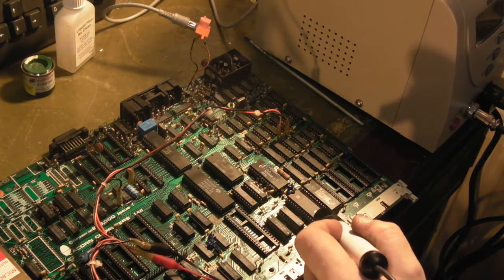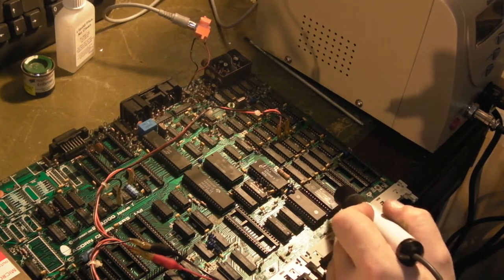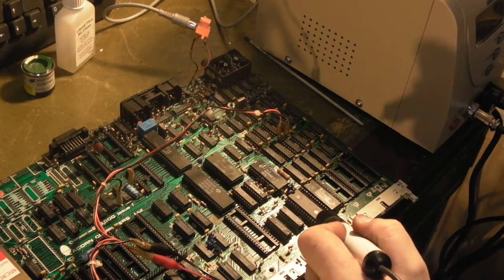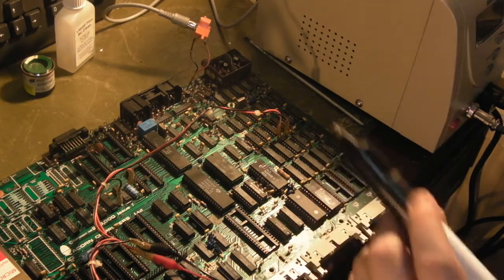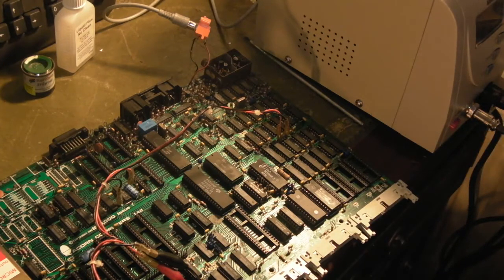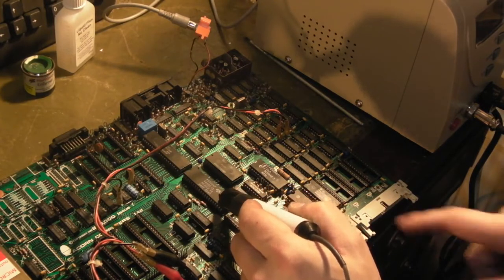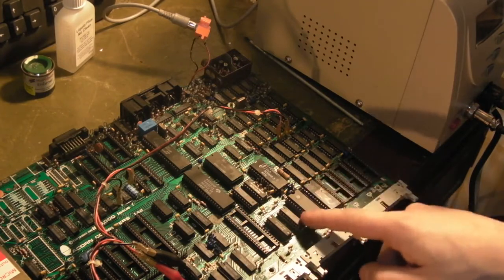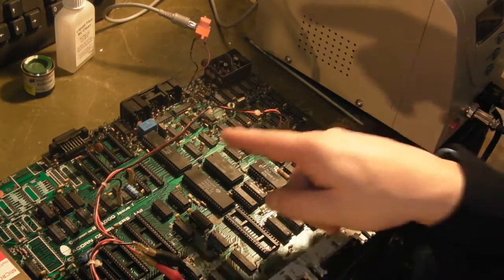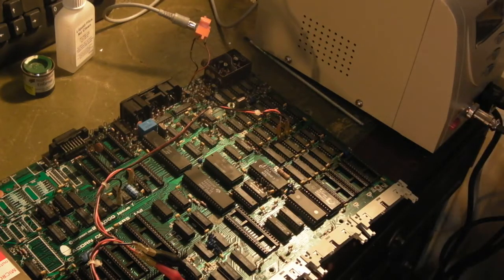We put a decent, really good socket there for the MOS ROM. The BASIC ROM's still in a crappy socket, but to be fair, when I connected across, let's have a quick look now. This video's too long, so we'll do it in the next video. What I'll do is go between all the data and address lines off the 6502, and check it between both ICs there, just to make sure we've got all the lines that we need to get from there to there. But I don't think that's the problem.